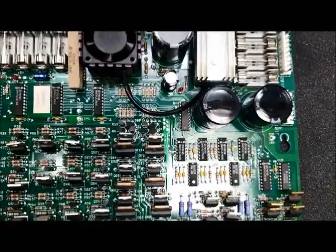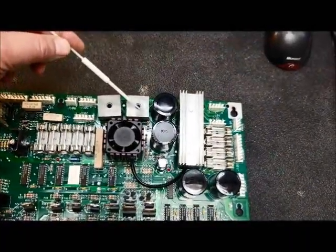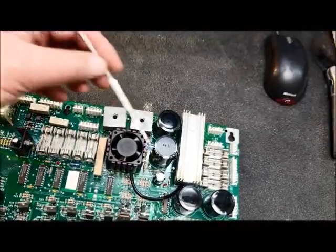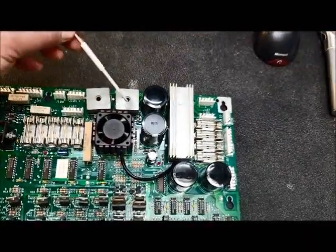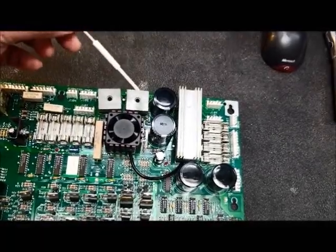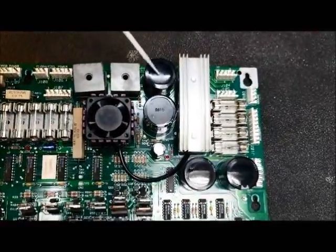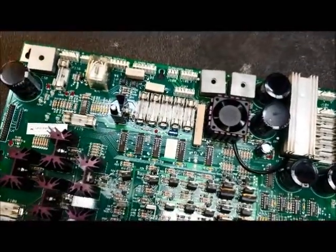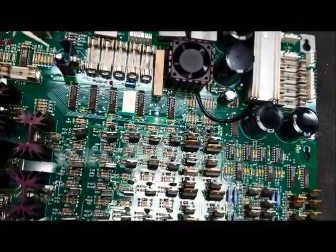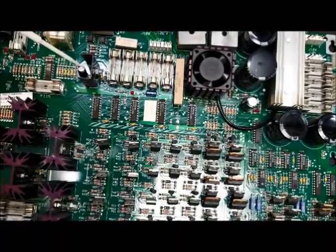These two bridges — BR3 here and BR4. BR3 is for your 50-volt source, and that's tied to this capacitor here for filter. BR4 is your 20-volt source, and that is C11, which is this capacitor here. That's for the 12-volt for the FlipTronic. So this is your 12-volt regulator here for the digital, and this capacitor here is the filter for that.